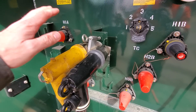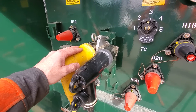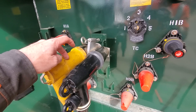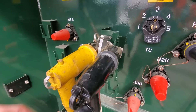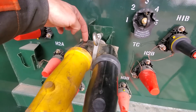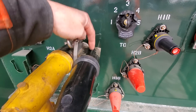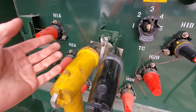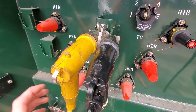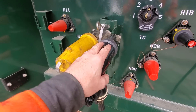Before you put a ground on, you've got to check for potential — you've got to check to see if there's voltage. You do not want to put a ground on this if it's still alive, so you have to confirm that 100%. I should also add that this is electrically connected — when that stinger goes into the double parking stand it is connected to the other side, so the ground can successfully ground this cable. But again, we have to check for voltage first.